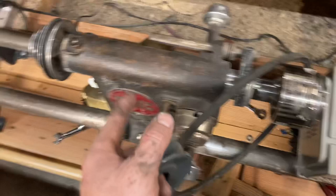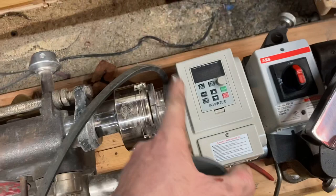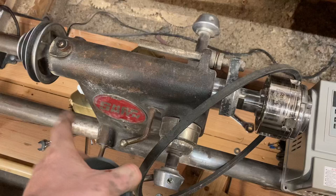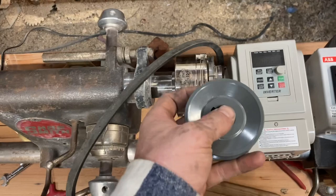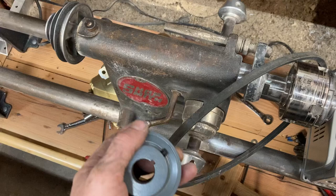The reason I'm going to three-phase with a VFD is that I don't have to keep switching the pulley belts to change speeds. I can just put on a fairly small pulley and vary the speed via the controller. These controllers even have torque compensation so at lower RPM they'll add voltage to accommodate the lower RPM torque load. I've got to make an adapter plate to mount the motor — a bit of welding and it'll be done.